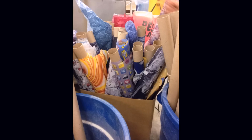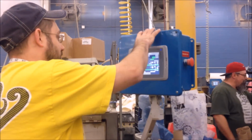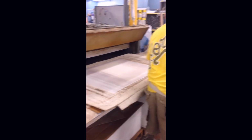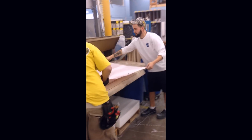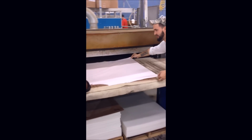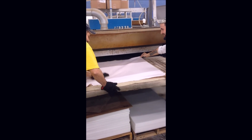The pattern you see on the outside of your brace comes from paper that feels a lot like wrapping paper. The oven is programmed to heat up the hard plastic. Crafters put the hard plastic block into the oven. Once it's soft, they place the paper, ink side down, on the hot plastic. The heat melts the ink into the plastic where it stays forever.